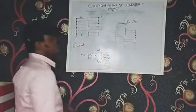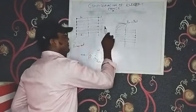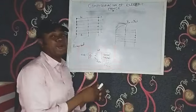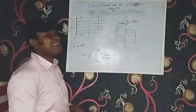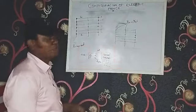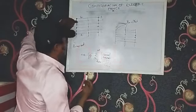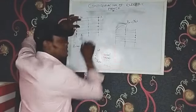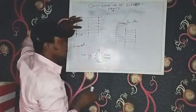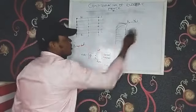Same applies to this. So the configuration I want to teach you about today is live, earth, live, live, earth, live. That's one of the standard configurations you need to use for your electric fence, even if it's an animal farm. This is one of the best configurations to use. So you have a live here, an earth here, and close to this live is an earth also. Close to this live is an earth also. You have them all together, close, side by side. Same also as this.